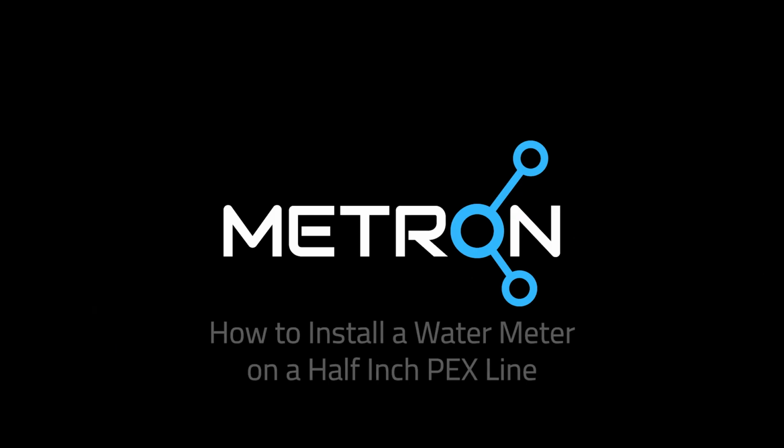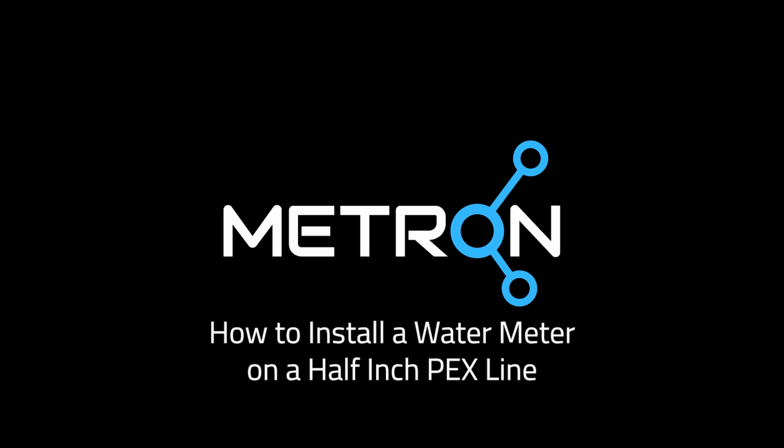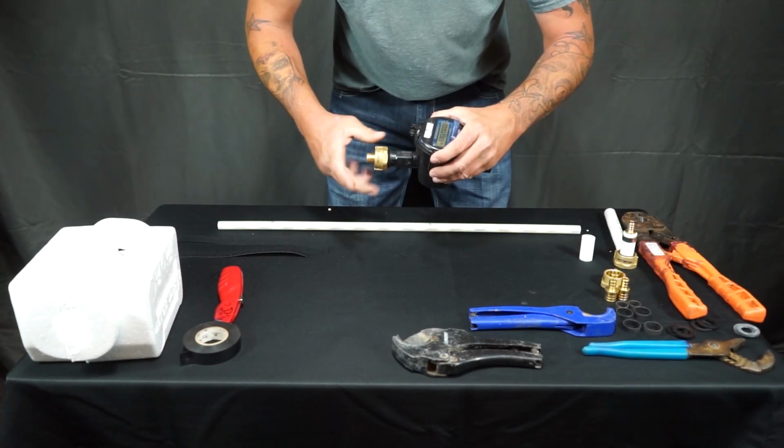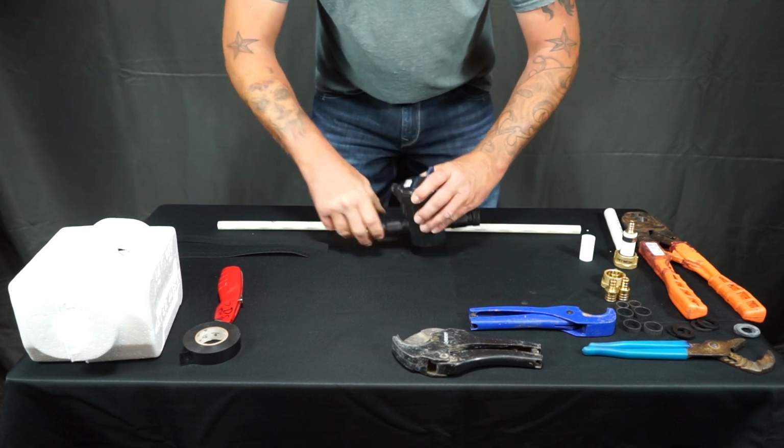In this next video, we're going to show you how to install a water meter on a 1/2 inch PEX line. You'll start by taking your meter connector and putting the gasket in it and snugging it up on the meter.